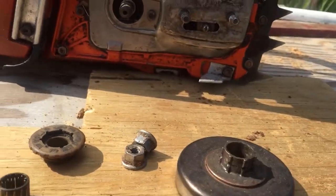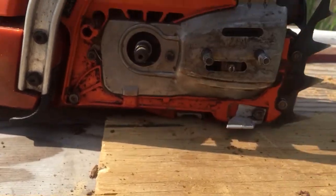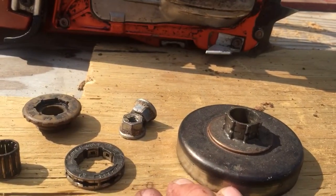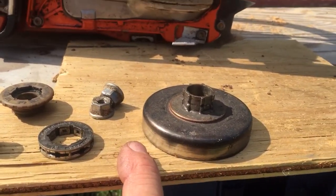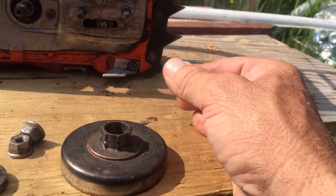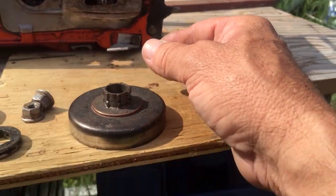I was wrong. For this model, the XP, it's excluded from lots of goodies because of this - it has enough power to do a lot more things. So I've changed it - we're going from a 0.325 to a 3/8ths, which means I could probably run like a 36 inch bar to mill some stuff when I need to.